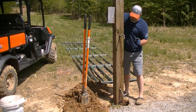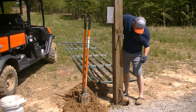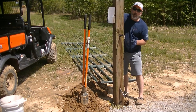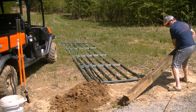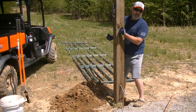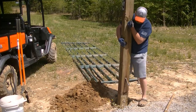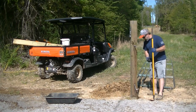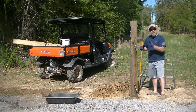This post was already used for the gate, so I've got to make sure I get it the same height as before, otherwise my gate won't fit. I've got it a little deep - it's more like 28 inches - I need to put a little fill dirt in under it so I can get it leveled with the ground where it was before. Packing the dirt so it doesn't settle as much. We have the post the right depth, I've got the angle I want. I'm going to put a little dirt in at the base, level it up, mix my concrete and pour it in.